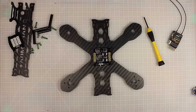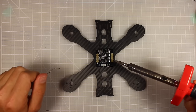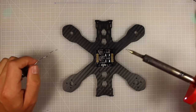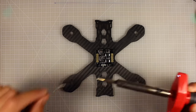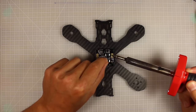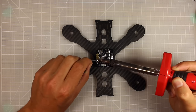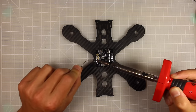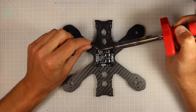Now we're going to turn our soldering iron on. I got this PDB because it's cheap and it has a five-volt output at the front, which is going to be great when pairing our Naze and receiver. The trick to soldering: make sure your iron is hot, clean the tip, put a little solder on the end, then get in and out as quickly as you can. Put plenty of solder on here — there's going to be a lot of joins.